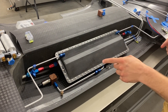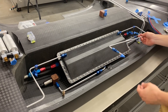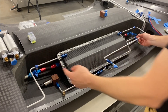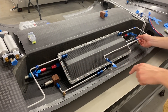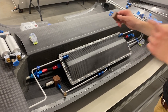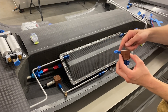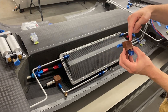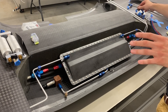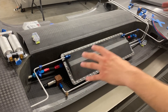In addition to that fuel pressure gauge we also have sight gauges — that's this plumbing right here. We have one for the left tank and one for the right tank that plumbs in right here before it comes to the sump, and then this goes to your sight gauge on your seat back. There's another manifold for the sight gauge — this little guy. Our tubing will plumb into this, it goes through the seat back bulkhead, and then our venting line comes out of that.